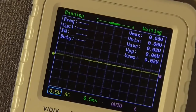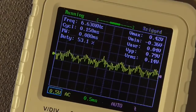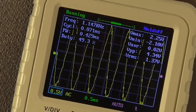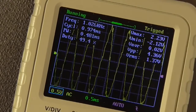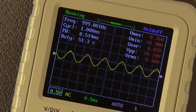So now I can hook it up to the microphone input, and I've got to change my amplitude yet again to 3 millivolt, and it's going to be noisy, but we'll see what happens. So I'll turn the knob up. Yeah, it's amplifying and we're getting noise, and we're getting about 0.75 volt peak to peak, but we're at the noise floor. DDS is pretty bad. So, yeah, we're getting 4 volt odd out on that channel now. That's only because it's more than what should be going into it. But it's reasonable. So, we can assume that that channel is working okay.